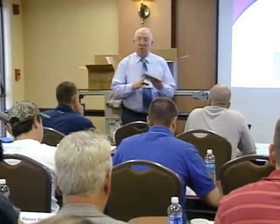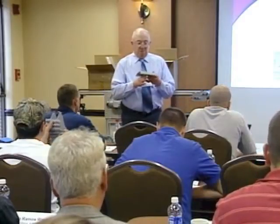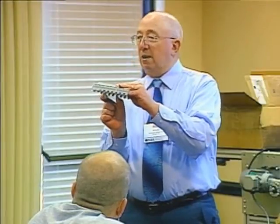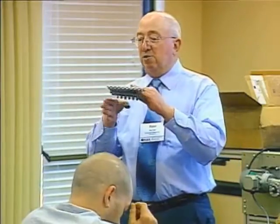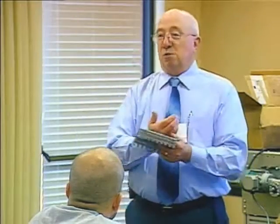Now, if you have heavy loads, long runs, or anything like that, then you may increase the number of sprockets that are on here. You may do 1 every 3 inches or 1 every 4 inches. Most of the manufacturers will tell you they would like to see an odd number of sprockets on here, so you can have one in the center, which is either pinned to the drive shaft or has locking collars on either side so that it can't move too far. The rest can free float. When you get out here to the outside edge, they'll usually recommend that you're inset a half to 1 inch from the edge with a locking collar on the outside, so again that outside sprocket can't walk out and walk off. These things are running loose, they tend to move. Do they stretch? They can. Does material move? Absolutely.